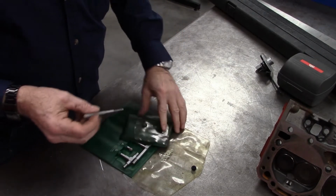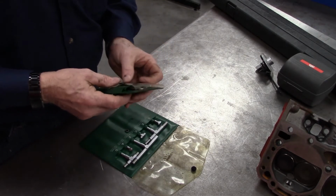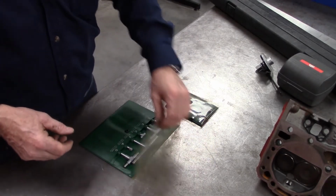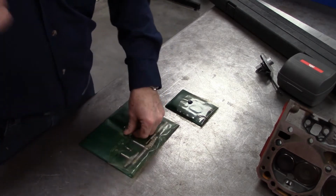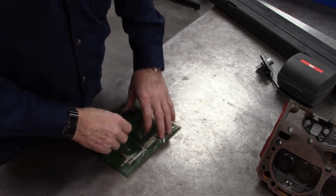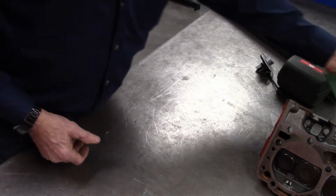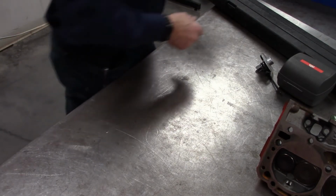Now, another option when you get smaller than that and you need to find out the diameter of a hole might be to just use a set of good drill bits and use that as a gauge for whether it's fitting or not, and then convert it to a decimal equivalent. What else? A couple other specialty tools.